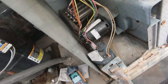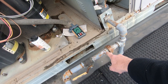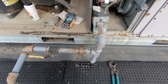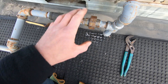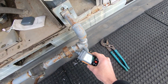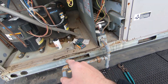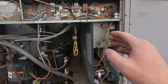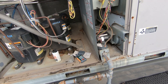I'm going to get my pipe wrenches and some pipe dope — we're going to take this apart. I think we're going to redo the whole union. All right, guys, I've got the fitting taken apart, cleaned, re-pipe-doped, and tightened back up. I hit it again with the leak detector and didn't get anything on it, so I'm going to douse everything with the micro-leak detector solution and then go ahead and get this control board and contactor replaced to get the unit back up and running.